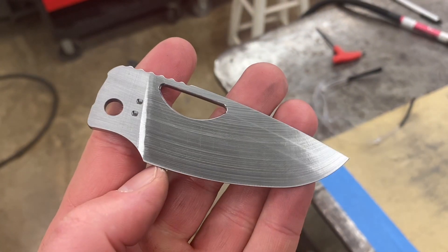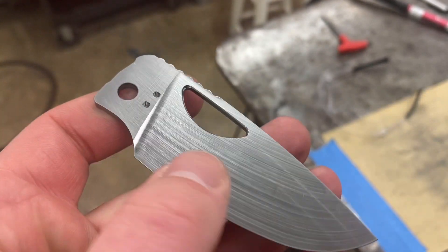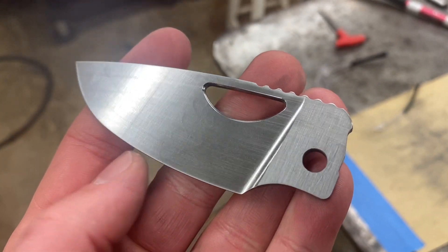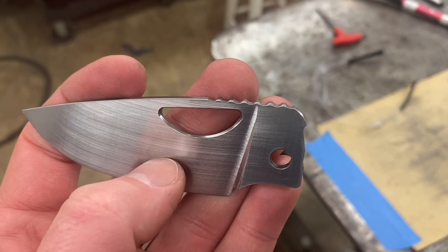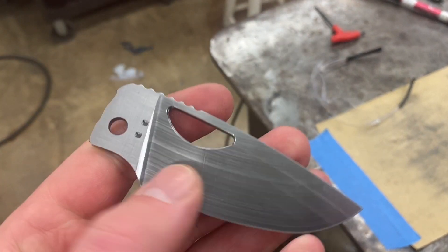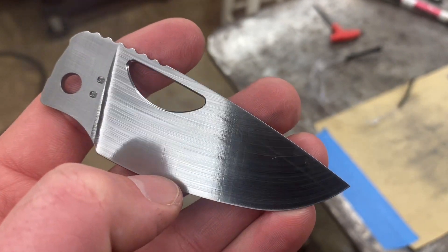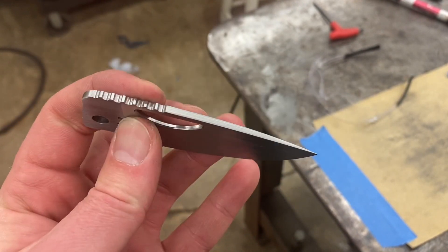Here is the finishing blade. There's a radius on that edge all the way around, both sides. The finish is pretty good. It takes quite a bit of stoning to get those lines out, especially on this side — it's a lot worse. The vertical lines you can see going up right here are fairly deep, but that's what they look like.